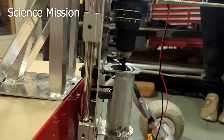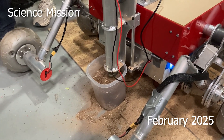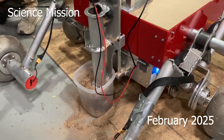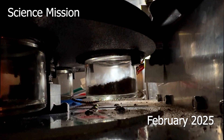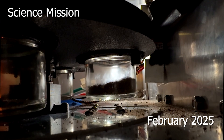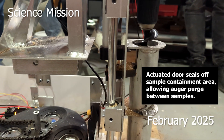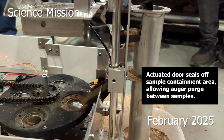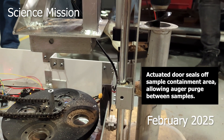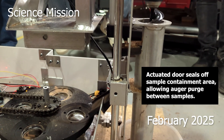This year, the science system was redesigned as part of the new chassis. Previously mounted at the front or top of the rover, the science package is now centrally located beneath the electronics box for improved stability and space efficiency. The collection system includes a drill on a linear actuator that moves an auger vertically to extract samples. The auger is housed within a sealed tube with a window that evacuates all soil above the collection depth. Underneath the rover, a rotating carousel holds four sample containers in an environment appropriate for either analysis of proteins and amino acids in the regolith or fluorescence-based bacterial detection. The carousel's threaded attachment allows secure sample containment to meet planetary protection protocols.